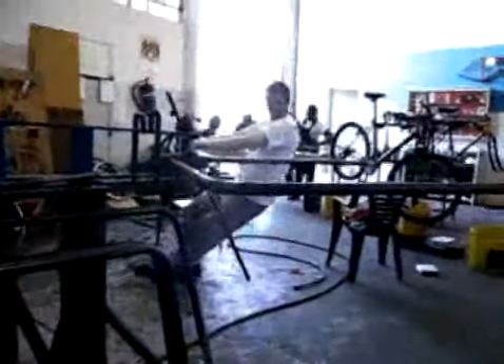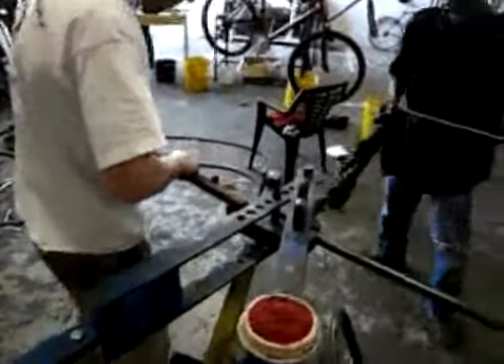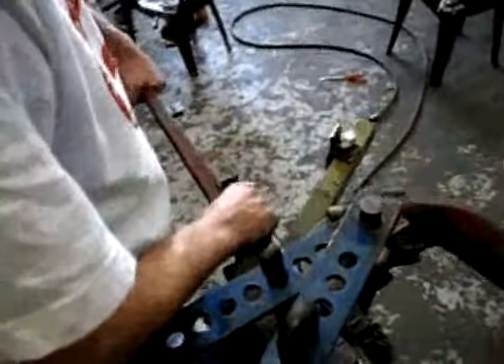Be sure to avoid aligning with the letters on the die. Note the stop on the bender frame, which has been calibrated to give a 90 degree bend. For every new bend, grease must be applied and spread onto the sliding block of the bender. The stationary block and the circular die must stay free of grease and be wiped clean periodically.